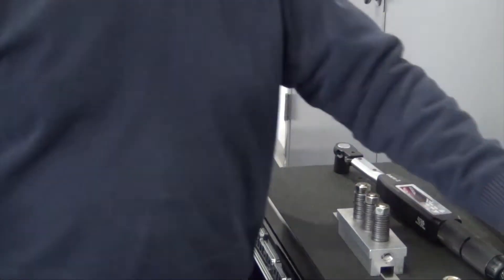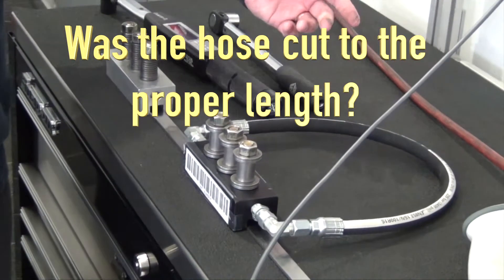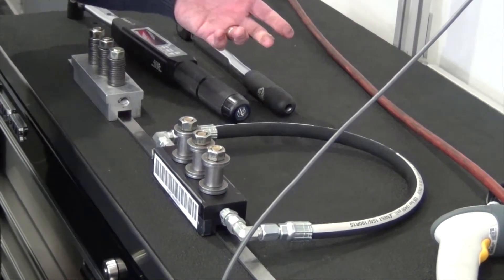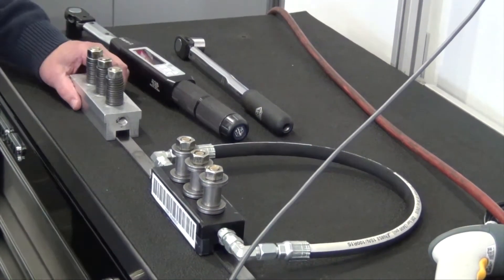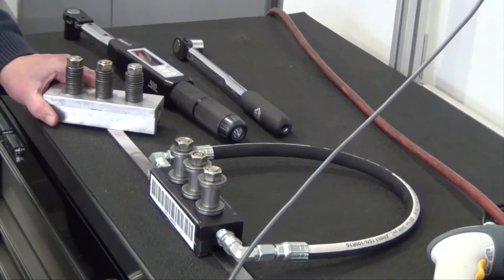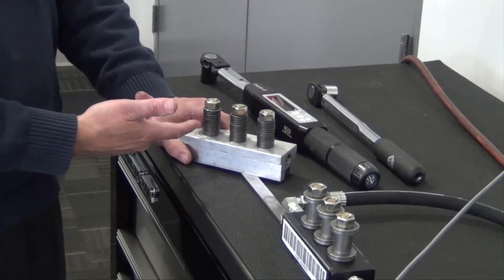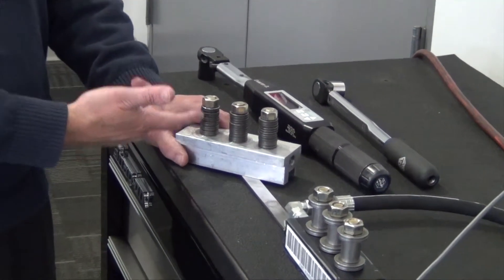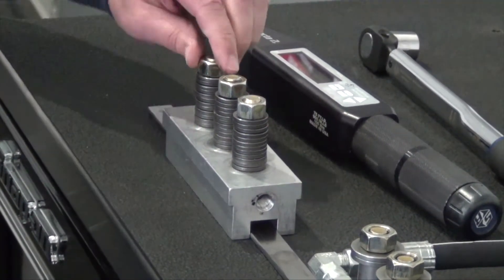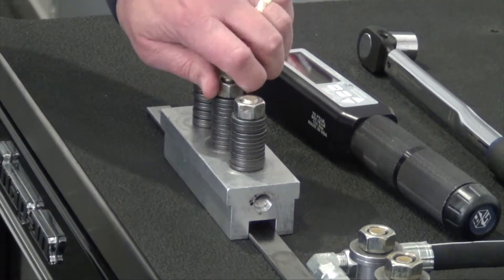One of the things about rubber hydraulic connections is the operator can never tell if the hose was cut too short — he really has no reference point to look at it. What I've done is I've taken a washer stack, and they all look about the same, but the operator doesn't have something to compare it to. I have these washers set up to be a soft joint, and what I'm going to do is identify that this is a softer joint than the other two that are set up for it.